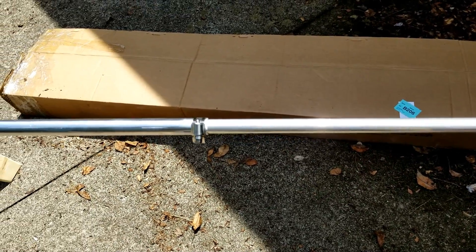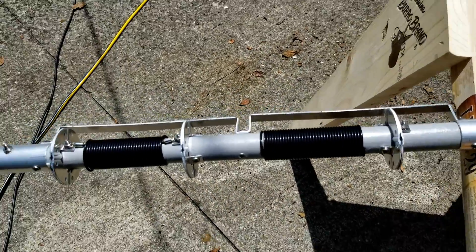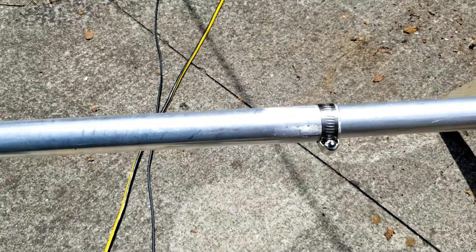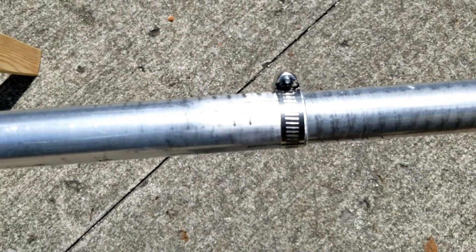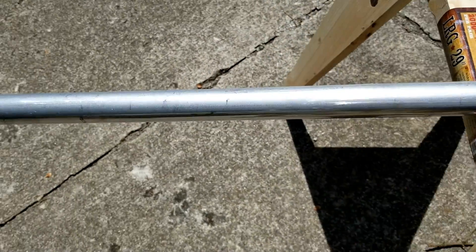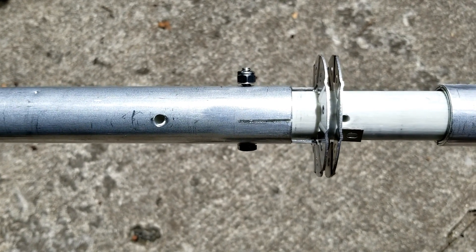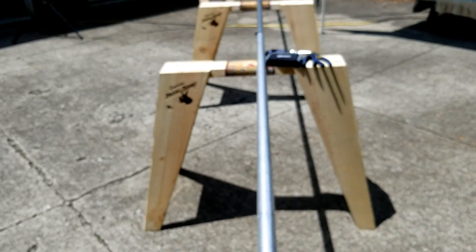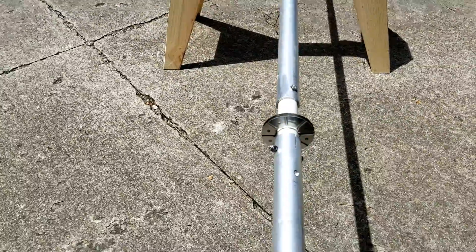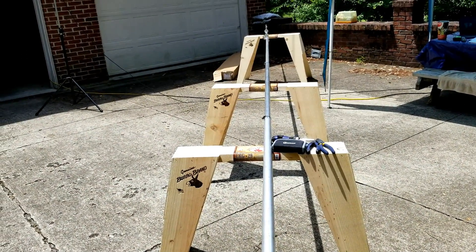All right. Now we have sections put together with hose clamps to make sure that each of these tubular sections stays together and stays where it should be. This is the top part, which is your longer frequencies with the coils. The hose clamps going down through here ensure that each section stays in place — they will not insert any further. They actually have dimples tapped into each of the pipes to make sure you don't insert them too far. There's an insulator down on this end, and we'll use those two collars there to anchor radials on the bottom end. It measures out to about 30 to 31 feet. Pretty darn long — so first stage is done.